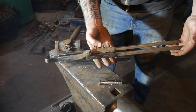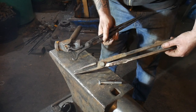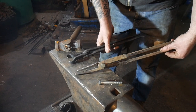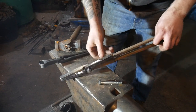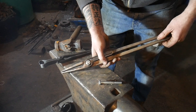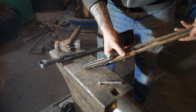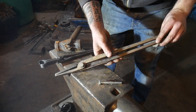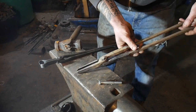The weight of these is incredible — it's not even like you're holding anything, it's absurd. Even these other ones are heavier than these. I want to make them look like a set of these; I made a couple of sets of these out in the States and they work really nicely. I've also made a few of these on courses. Quick disclaimer: I have done a bit of grinding on here, I wasn't happy with the finish. I don't actually know how to finish titanium all that well. I know you can get some really nice temper colours on it, which I'm going to try to achieve. I'm not 100% sure about this creasing that's happening all the way up and down, and I've been a bit harsh with the forging process — it could have gone a bit softer. But overall the forged finish I'm quite pleased with; they've come out quite nicely and the punched hole worked quite well.